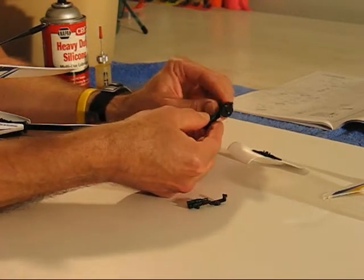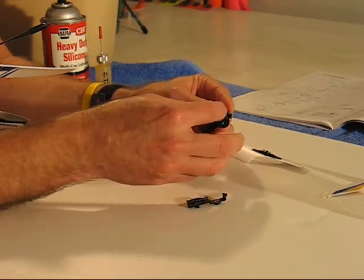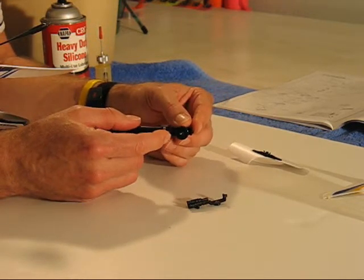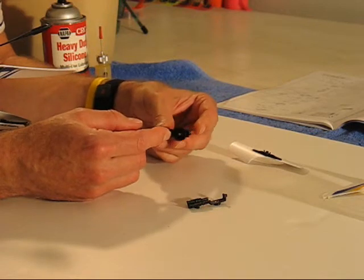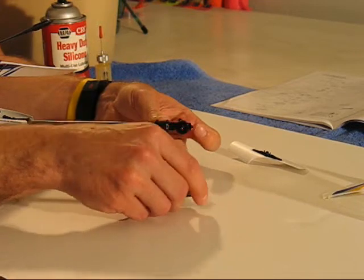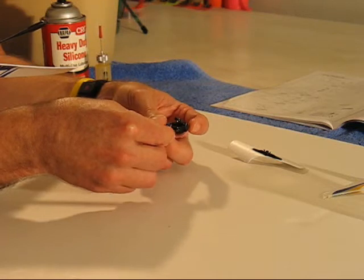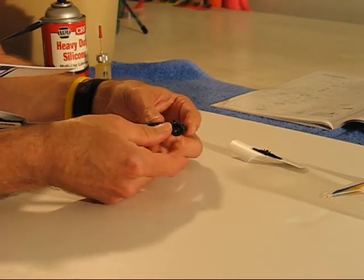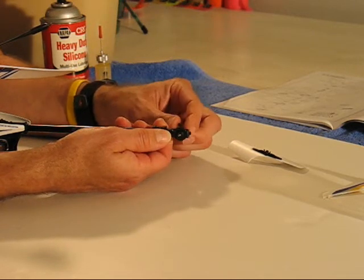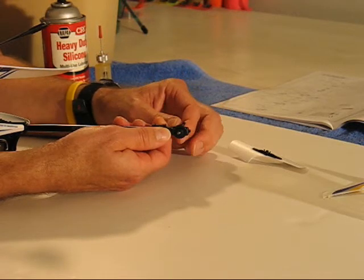As I mentioned, this has lateral play in it. I like to push it all the way in since that crown gear has to go on the left side of the gear on the shaft drive. So: gear on the proper side, bearing in the groove — looking good. Now I'll get the opposite half and put that in place as well. I'm just going to pinch this temporarily and spin it — the gears are meshing properly and it feels very smooth. So we're ready to proceed.